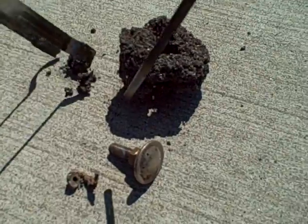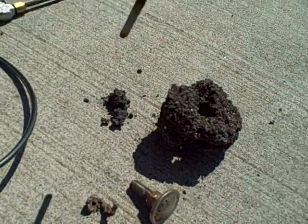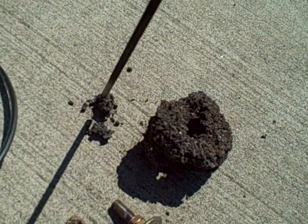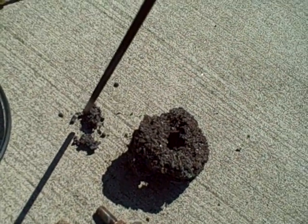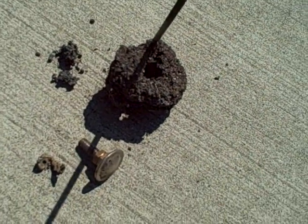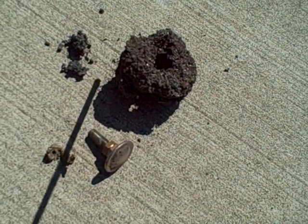We're thinking as well, we've got a collection of ash left over from a previous gasifier experiment. We might try a nice thick bed of ash at the bottom of this rather than sand, as it may have a higher fusing temperature and eliminate this ugly fusing problem we've been having with the sand granules.